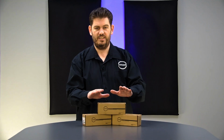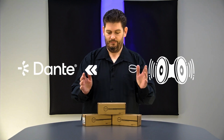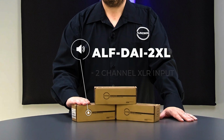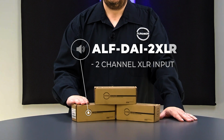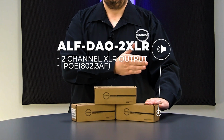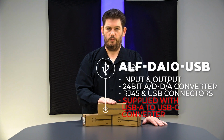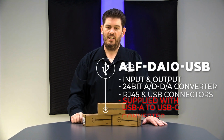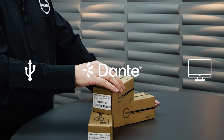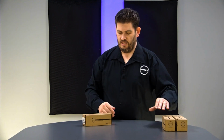Well, so there we go guys. We have three of the Dante to analog converters, or analog to Dante, either which way. First off, the input converter, so that's analog audio input to Dante. We have an analog audio output converter, which means it does Dante audio input to analog audio output. And then we have the USB converter, which is essentially a two-channel device with both input and output. That basically converts your USB audio to a Dante stream, and that's then connected to your PC. So we'll take a look at all three just a little bit in quick succession.